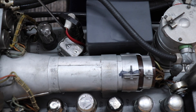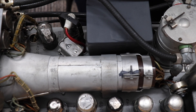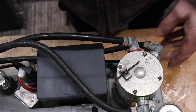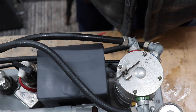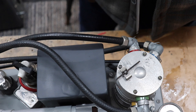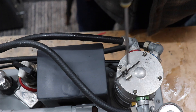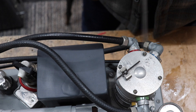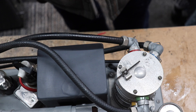This valve here is a 2X2, which is an EHT rectifier for the high tension supply of the cathode ray tube. Then there's a 6X5GT down there, which is a HT rectifier. The most interesting thing is this rather unusual component here. You can tell this is World War II by the coax connectors — similar to the ones on a 19 set, really old school. And this unusual thing, I really have no idea what it does. I have actually fired this up already and it makes a noise, so it's some sort of motor. That's the transformer which runs off 115 volts, 400 hertz — a 400 hertz transformer.